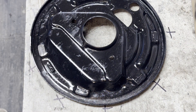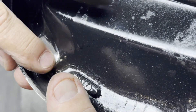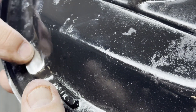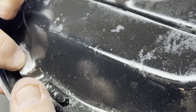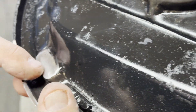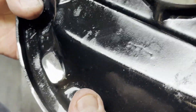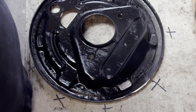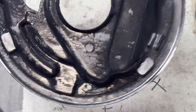I've sanded it down now — it's a little cup shape, curved a bit, but there's nothing to grab onto the shoe now. It's only a couple thousandths of an inch deeper than the rest of the pad. Some of these get really deep, and in that case you've got to weld them and then grind them down — you'd usually need a mill to surface them back down to size. But now they're nice and flat.